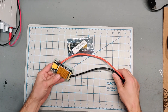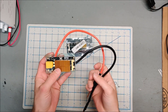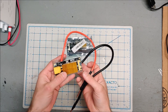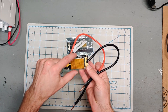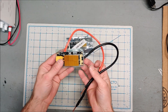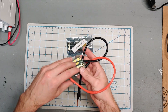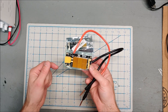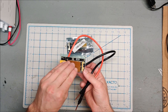In some previous videos I tested a bunch of spot welders and quickly decided the BIFRC spot welder was by far the best. It has a very nice interface, good power level selection, and overall excellent performance. A lot of that has to do with supplying your own high-quality leads — everything is soldered on, which reduces current drop — and with the right battery this thing is fantastic.